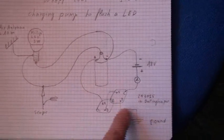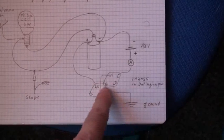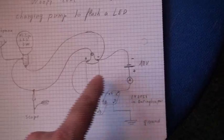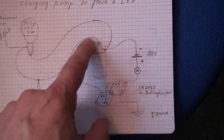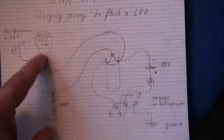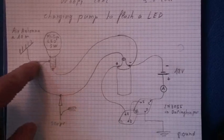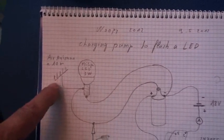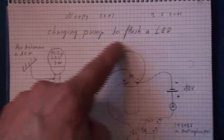You have the car coil here, and the Darlington pair here, with the base connecting to the ground to get the oscillation. 18 volts here, the amp meter, and on the high voltage output, we go on the side of this LED, which is very important, and from this side we go to an antenna 10 meters outside of my house. The main plug here goes on the negative.